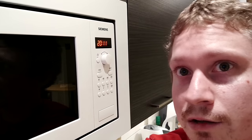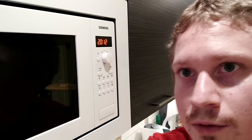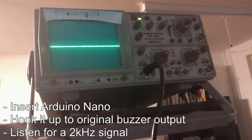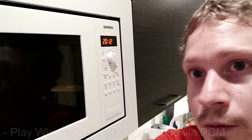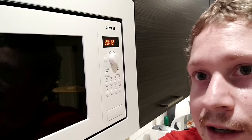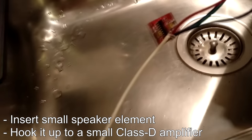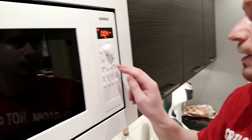So I took care of that problem. I removed the built-in buzzer and replaced it with an Arduino Nano that listens to the two kilohertz buzzer signal, and when it hears it, plays Windows XP's startup sound instead. I placed a small amplifier and a small speaker element inside to play something like this.